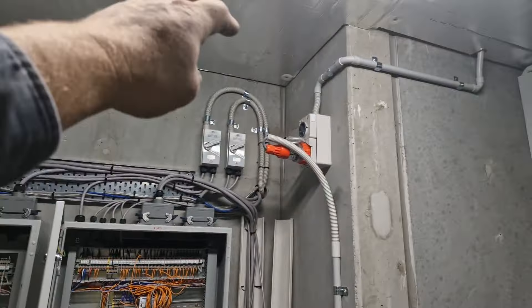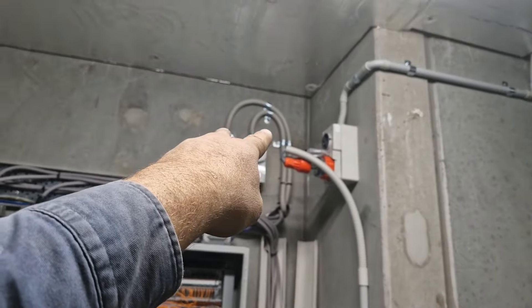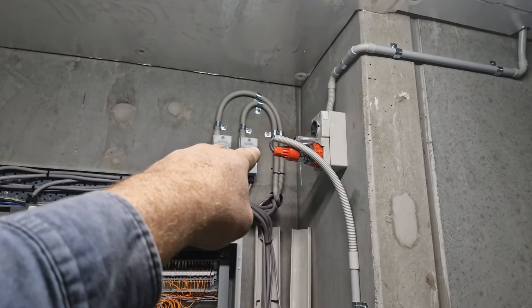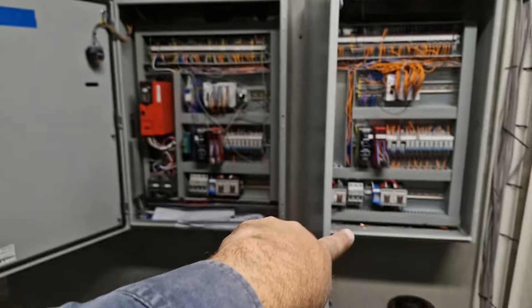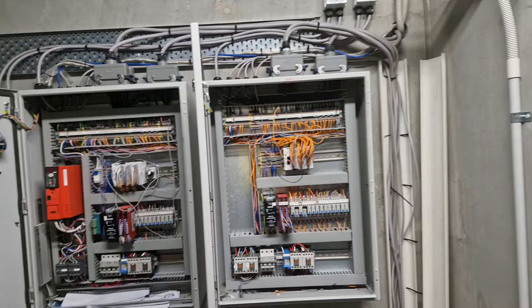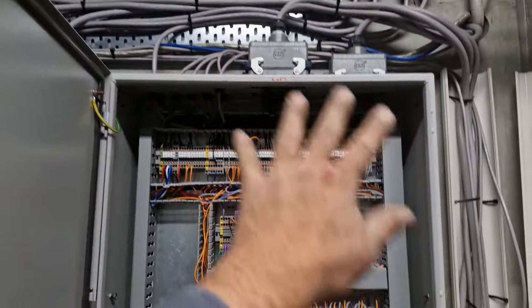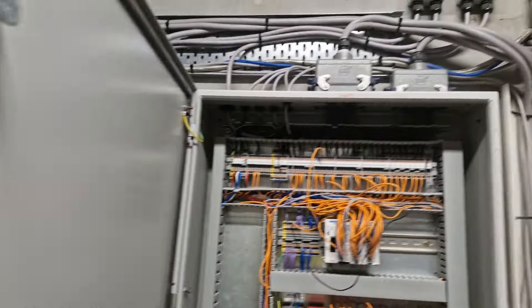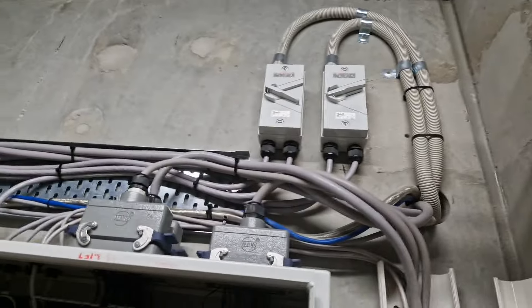Anyway, I took the power supply from that one, ran it into that UPS, went out of it into each isolator, into a second pole. So from there we have backup and backup, and power supply and power supply — one for each panel — now through a two pole switch. So when they're off, absolutely nothing is live in either panel respectively.